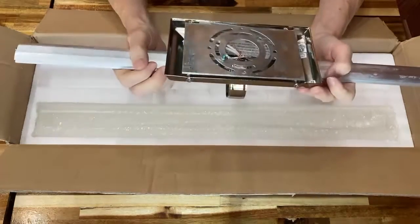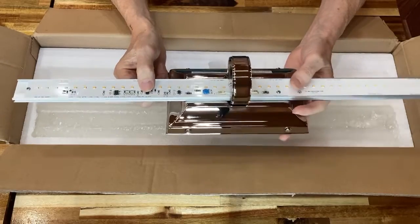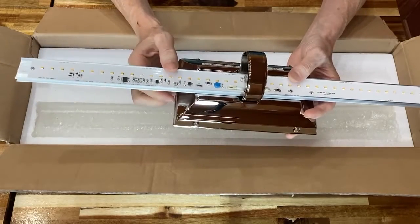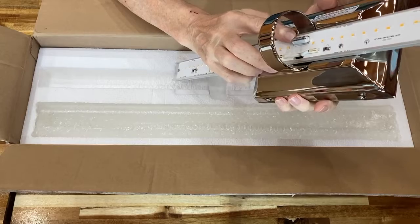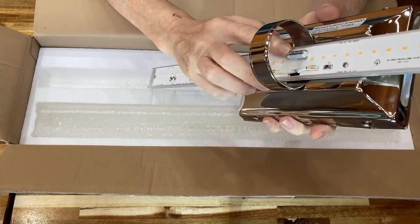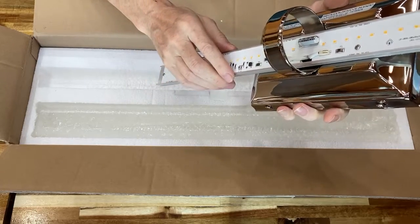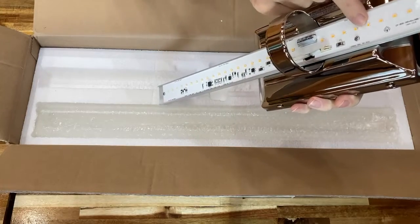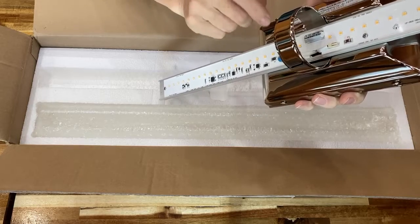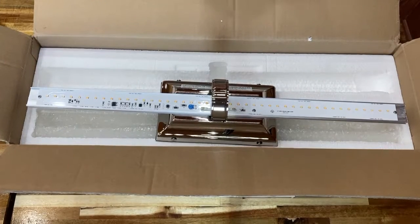All we have to do is remove the light panel strip and replace it with a low voltage strip. Something interesting to note is this capacitor right here — this is what fails when one of these light panels fails. So if you've experienced LED failures, it's not because of the LED chips; it's because of the capacitor. So we're going to remove the offending high voltage part and replace it with low voltage.